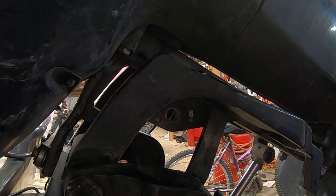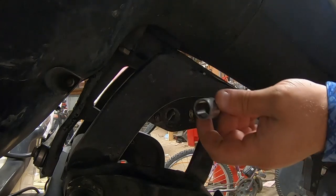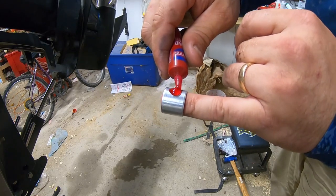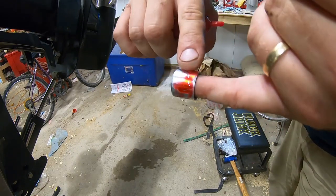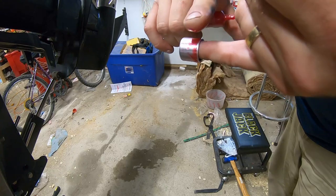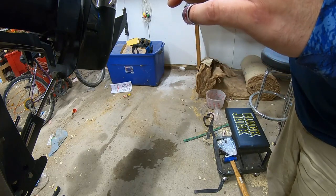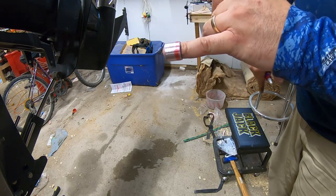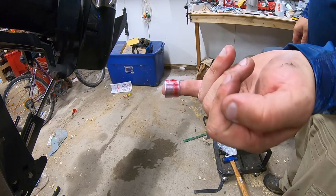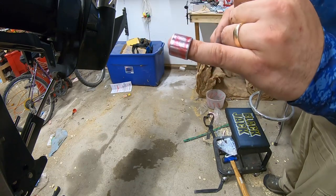The bushing is out. You can see the old one that came out — it probably would not have needed replacing, but since I have a new one, might as well. Before we install the bushings, we're going to apply a real thin film of red Loctite all the way around. This is a bit messy to do, so have a rag handy. These are metal so they won't hold the Loctite very well, but do the best you can. Then we're going to be very gentle inside — I don't want to scuff that up or ruin the inside coating. Once we have the red spread on evenly, we're ready to put our bushing in.